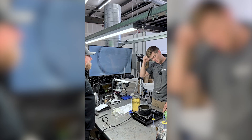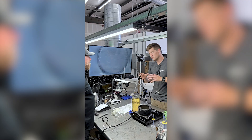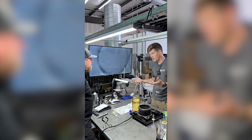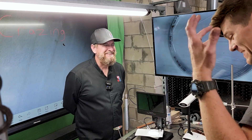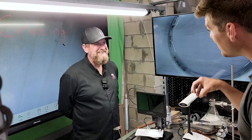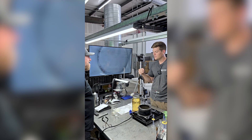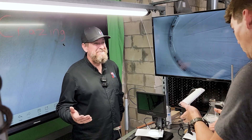The question is: what happens when you have a leak in an evaporator coil? A slow leak over time creates an oil residue on the coil which fills the drain pan. Where does the condensation go in a normal heat exchanger in a Florida market full of humidity? Down the drain line. What's the drain line made of? PVC. We're literally washing oil down our drain lines that is eating the drain line from inside. I've seen white slurry plastic from drain lines over time that has degraded from the surface, and I'm wondering if that's associated with this.